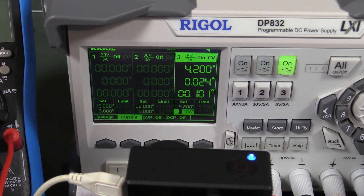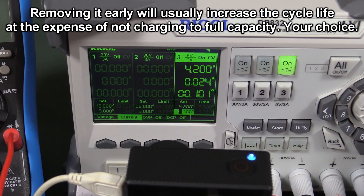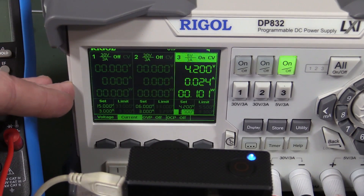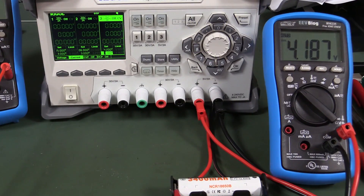You want to use your battery, so take it off once it drops below 5 or 10%. You can actually take it off at any point during the charging process and use it. You can take it off when it switches from constant current to constant voltage charge mode, but it's only going to have like half the capacity put back into it at that point. Once you get below that 5-10% figure of your charging rate, it is very much diminishing returns. So we can switch that off and bingo, we've got a fully charged battery!